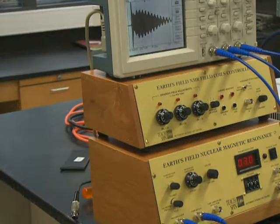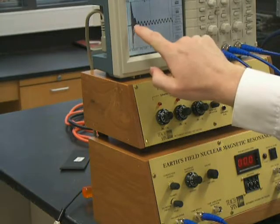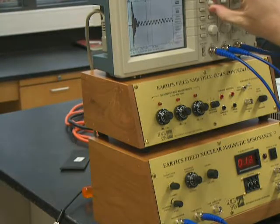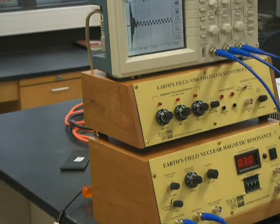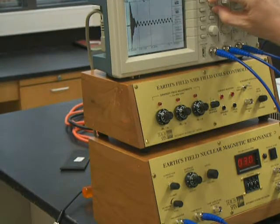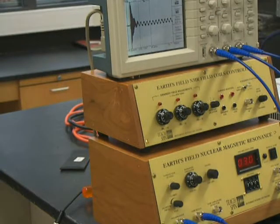I'm going to take the water out of the inner solenoid coil — here's the water bottle — and do it again so we can see what just the coils themselves look like. The coil transient itself has a relaxation of about 31 milliseconds, maybe up to about 44 or 50 milliseconds. The manual talks about cutting off the first 50 milliseconds so you're not confused by that transient coil.